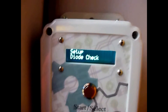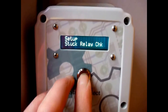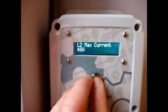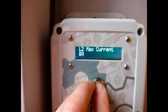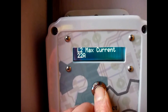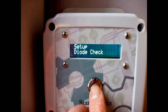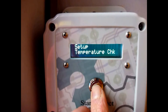If you want, you could bring that max current down temporarily — for example, if you were charging from solar PV, you could set it to 6 or 8 amps so the car just trickle charges. But a better way to do that is via the RAPI interface — via serial, HTTP, or MQTT with the Wi-Fi module. And then there are a number of safety checks that you can turn off if required. The default is with them all on, and I highly recommend keeping them all on.